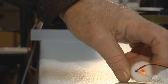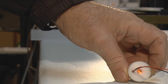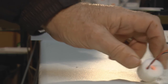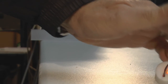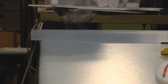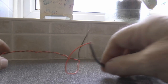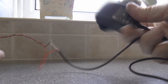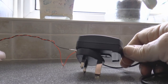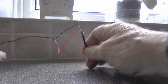First of all I'll have to increase the size of this centre bore so that I can actually move the LED to steer it. Then I'll have to steer it with some grub screws through the outside of this diameter here, which is one of the reasons I left this diameter so large — so I could put grub screws through there if needed. Although my plan was to drive this with its existing battery pack, it was becoming too much hassle, so I decided to use a standard mains-driven 5-volt DC regulated power supply to drive it.